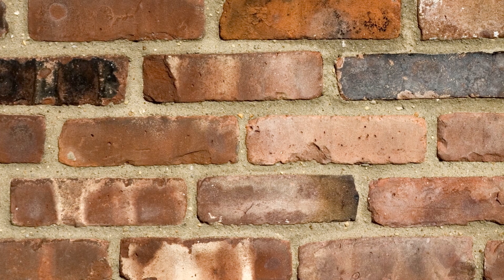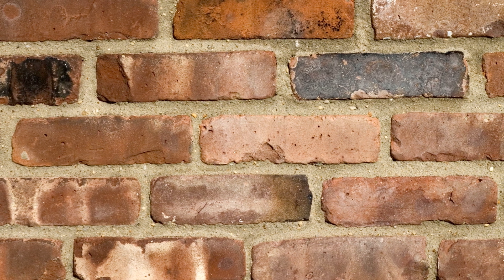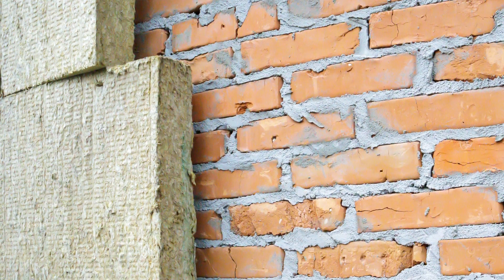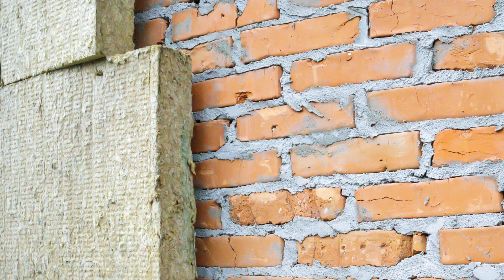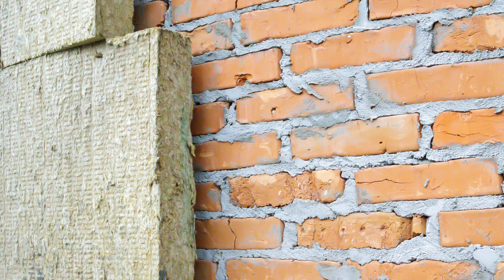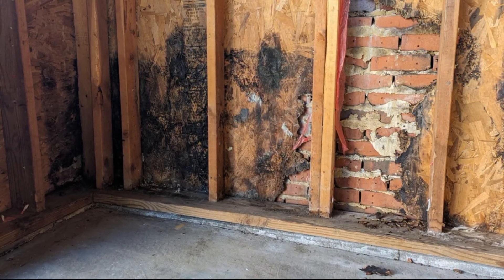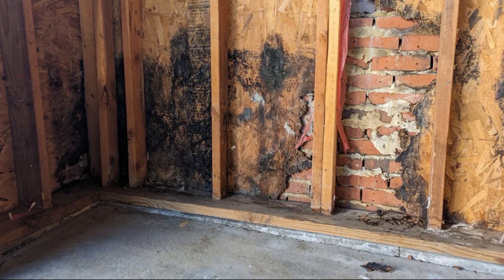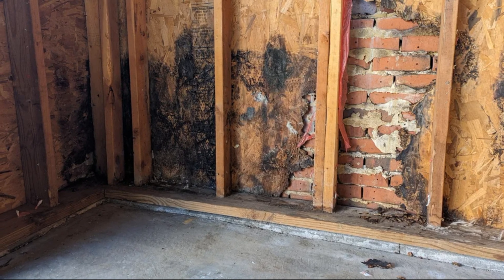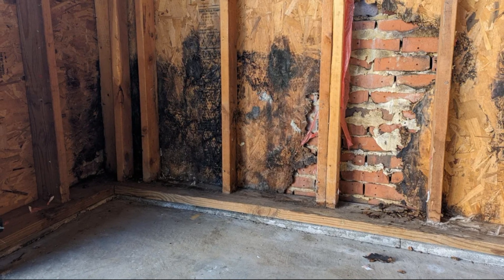So if I'm understanding correctly, you obviously can't remove that brick veneer very easily — and if you can, it's very expensive. You want some method of installing rigid insulation over that brick veneer, and that's a completely valid strategy. We want to make sure it's able to support the weight of that rigid insulation and any cladding installed over it. This is actually a technique we've used before where we have a brick veneer wall with a wood frame, a deteriorated exterior sheathing, no WRB installed, or tar paper that's peeling away — it's a very complex condition to address.